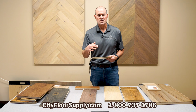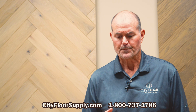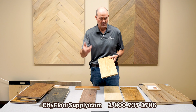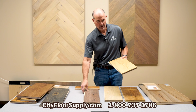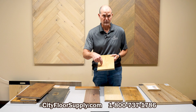So all of those things you definitely want to discuss with either your client or the homeowner or the builder, architect. All of those are going to decide, one, what species you're going with, because the species is what you're going to have stained or what treatment you're going to have on it. Whether it's got black bleed or whether it's wire brushed. All things that can be done to solid can be done to engineered flooring.